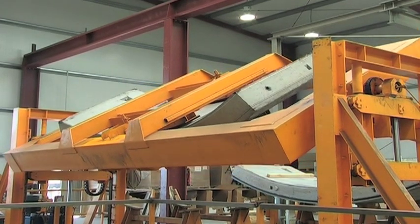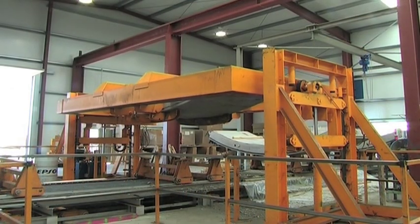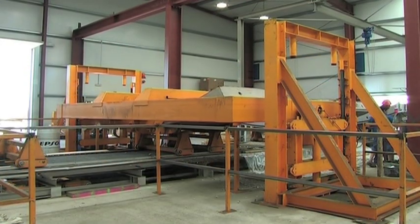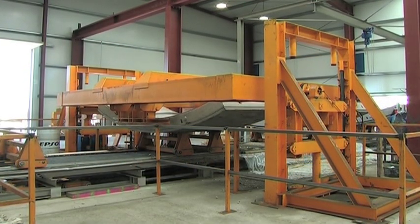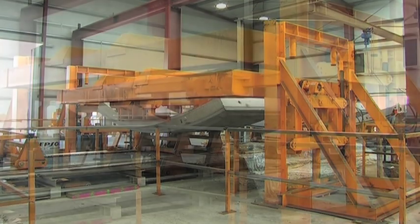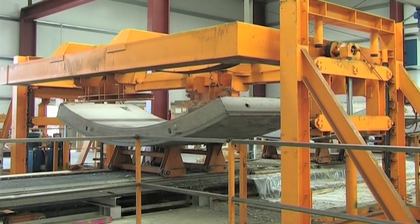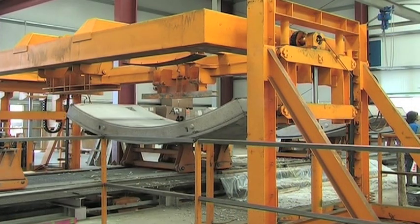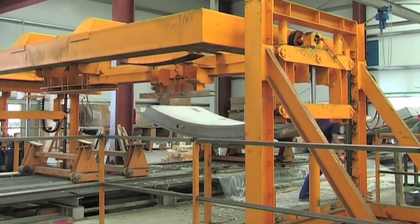The segment has different hollows and turnings to assemble different rubber pieces to it. These pieces are glued to the concrete in this phase. At this stage, each segment is marked using different painting techniques with its ID and all the necessary information. The segment leaves the building area and is transported to the storage area.